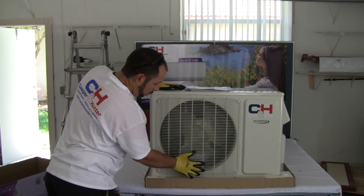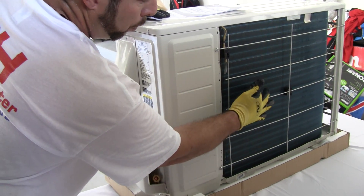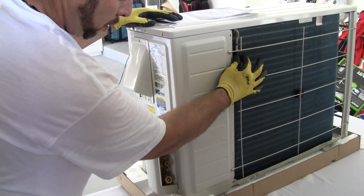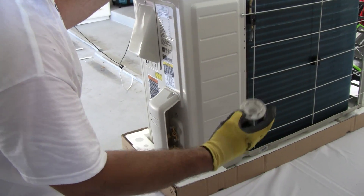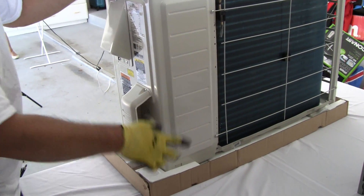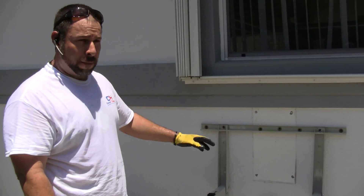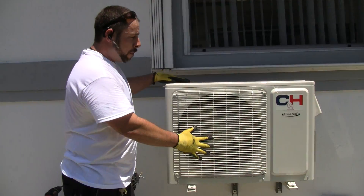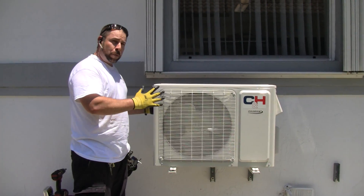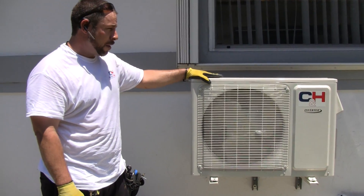Make sure there's no damage to the fan or the grid. On the back side there's a coil that wraps around — check that the coil is in good shape with no pushed-in dents or dings that may cause leaks from shipping. You'll also see the outdoor sensor, a condensation drain at the bottom, and your flare and electrical connections. Once the wall mount is set up, bolt down the condenser making sure the condenser fan is blowing out, which protects the coils from debris and the environment.